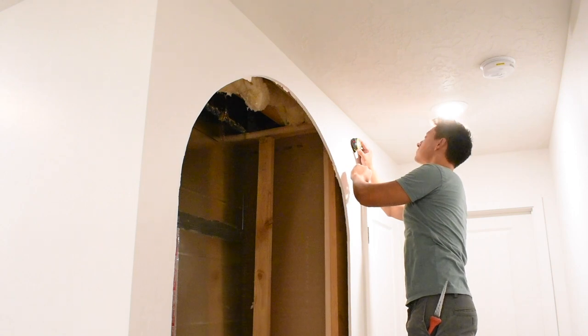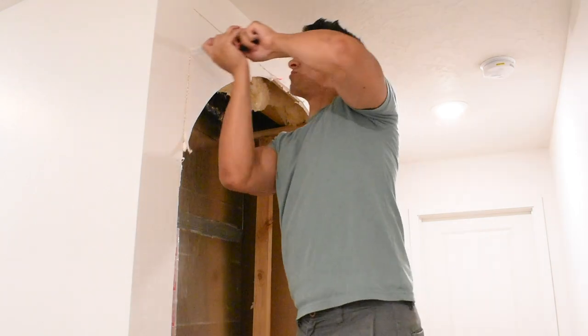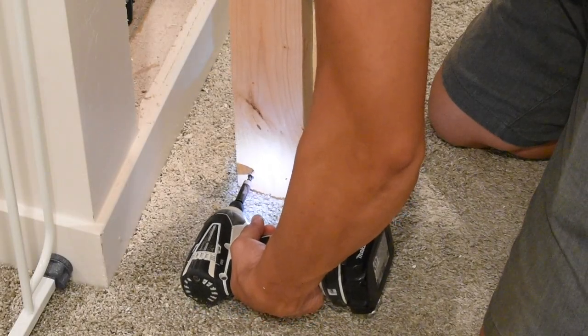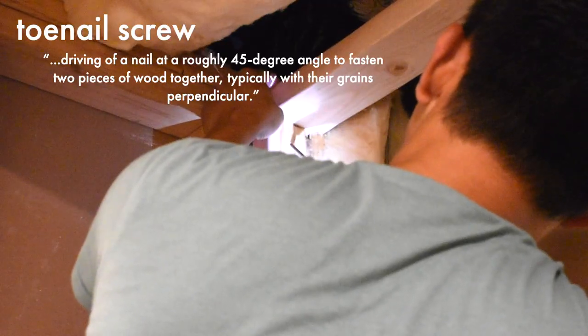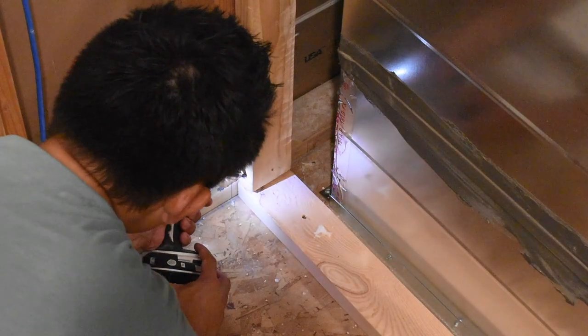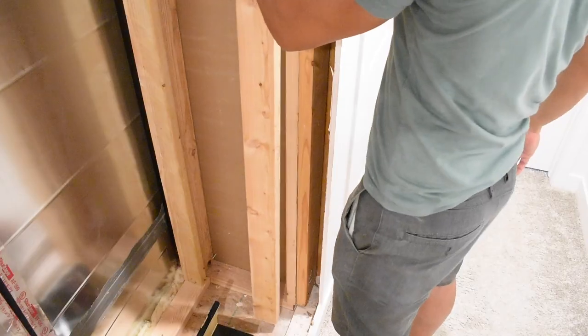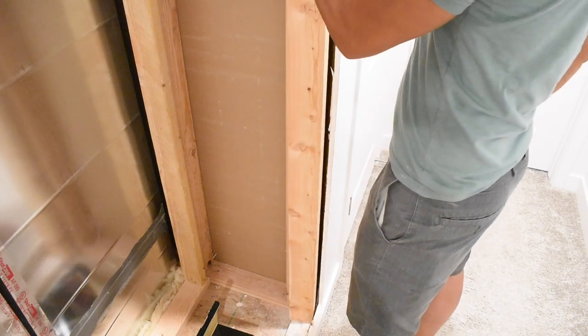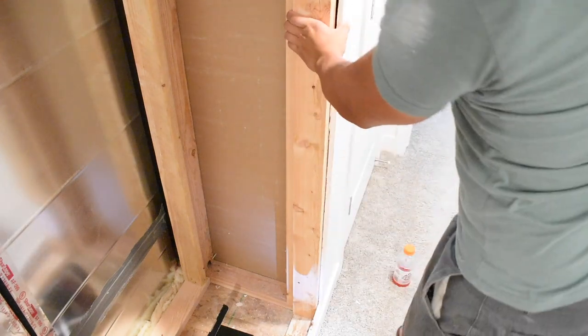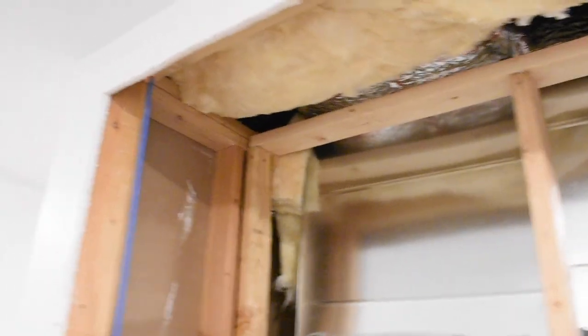This project started out with an arch design, but I changed it and decided to go more farmhouse shaker style. I cut more studs to frame everything out, pre-drilled my holes, got some wood screws, tightened it up, flipped them over, and did an impromptu toenail screw so all the studs were secure. Did the same thing to the bottom — one on the front, two on the sides. I framed the front part of the shelf area and secured the stud by screwing into the material behind it, which also supports the existing sheetrock. I had the back framed out to protect the air duct and studs in the front to support the shelf and secure the sheetrock.